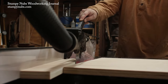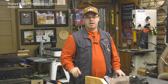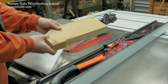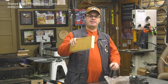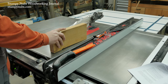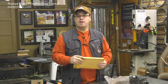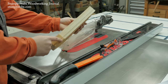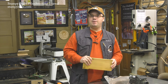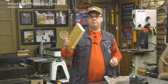Push sticks are essential safety devices. As a general rule, if you can spread your fingers and touch the blade with your thumb and the fence with your pinky, you should be using a push stick. In most cases though, I prefer a wooden push block like this one — you can make them yourself from just one two-by-six or two-by-eight. It's tall, so my hand is well above the blade, and I like the thicker material because it's less likely to tip, which could force the board toward the blade. The heel hooks on the edge of the board as I push it through the cut while the body rests on top to provide downward pressure to keep the board flat on the table. Sometimes, such as when I'm cutting thin strips, I'll let the blade cut right through the bottom of the push block. But for a push block to work properly, you have to have it nearby — you don't want to be halfway through the cut and your push block is out of reach, because then you're likely to take a risk and make the cut without it.